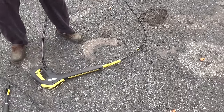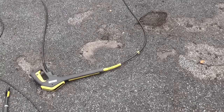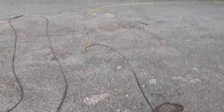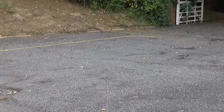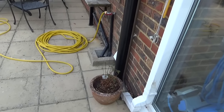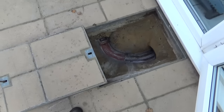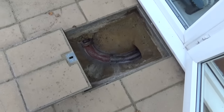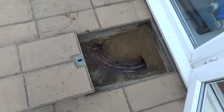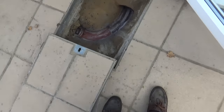Now that is the drain cleaner connected, and to give you an idea of how long it is, it goes down there across all the way to over there. This is the outlet from the utility room — it comes down there, it's only a short distance into that gully. The blockage was at the other side; there's a small distance there that I'm going to jet, and then we're going to do the long length through to where my trusty helper is over there.